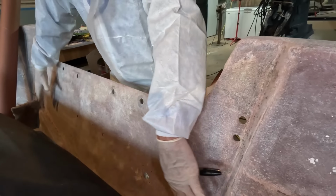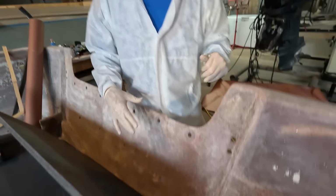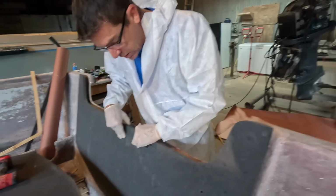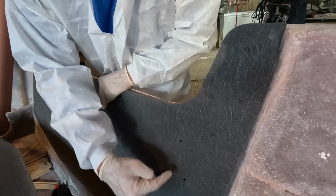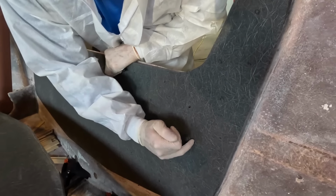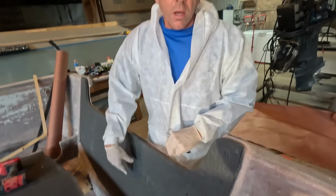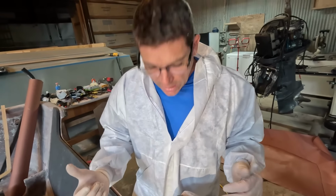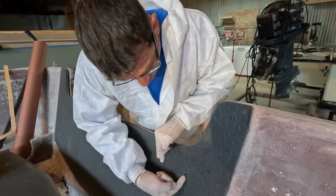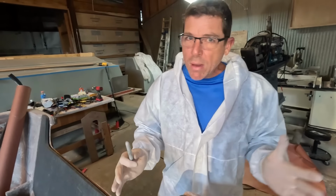or material or your fiberglass resin and you've resin coated the Coosa and you're ready to bond it, you can tell if you've got a good bond, because what's gonna happen is as you clamp this down, if it's made full contact, you'll actually see resin or putty squeeze out or start to squeeze out through some of these holes. And if for some reason you're not getting good squeeze out, what you can actually do is take some resin and actually get it to go back in the hole and fill any void that may be back there behind the panel.